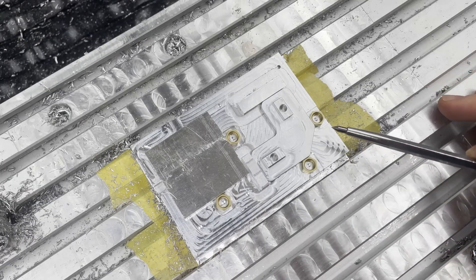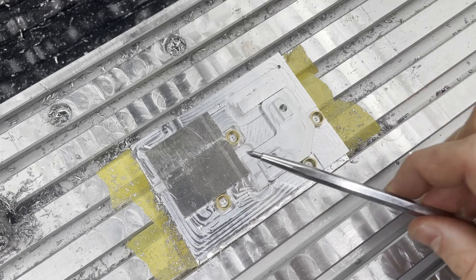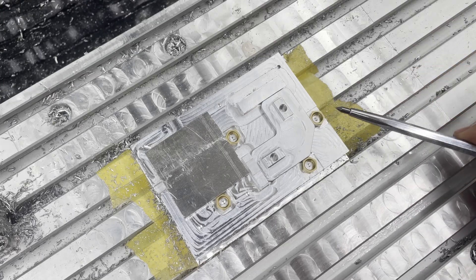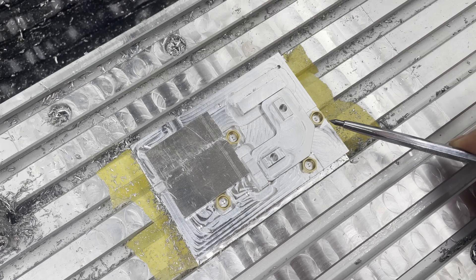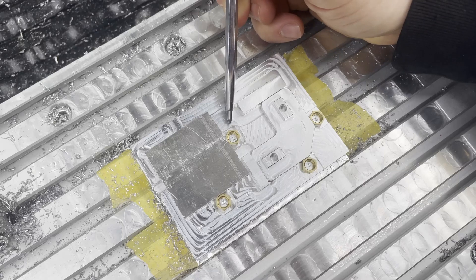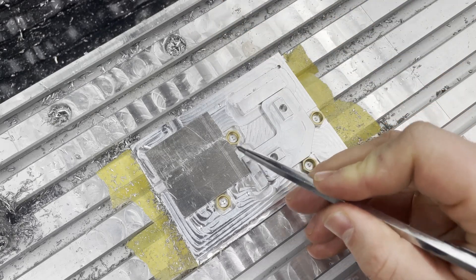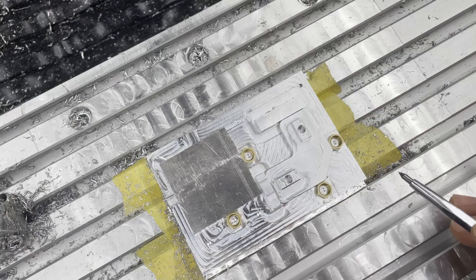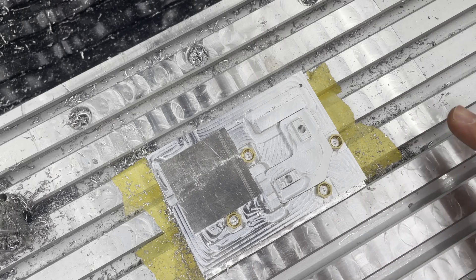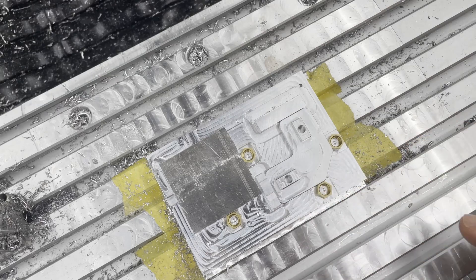So this is the plan. I've put some test pieces in here to mock up how the raw stock and partially machined stock will sit in the fixture, and also put in the hex nuts from the Mighty Bytes. This is how I want to hold on to the part. I may need to increase the stock size a bit because I'm not sure if I'll have enough clamping on these two sides, but it looks like it should work. This means I can remove the fixture from the T-slot table to drill out the holes and prepare the threads for the Mighty Bytes.